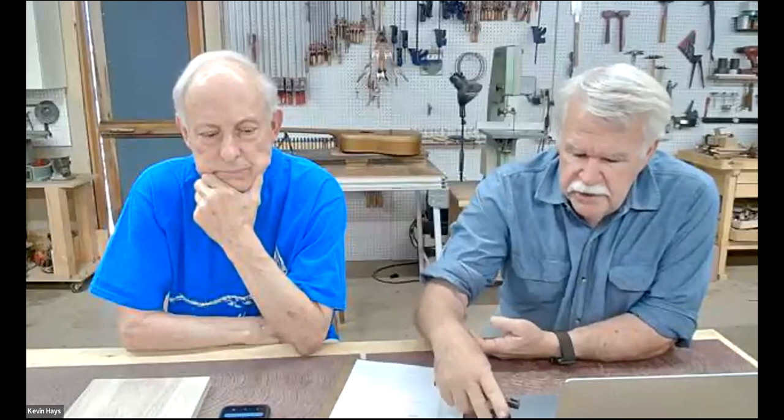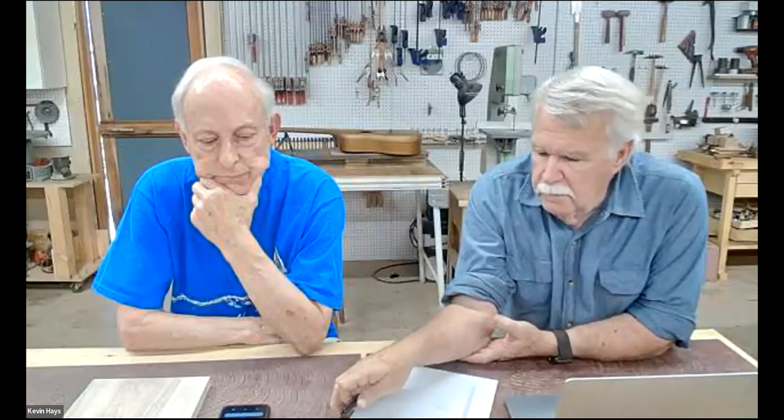Okay. Yeah, I wanted to address that a little bit. One of the things I did professionally, in addition to the woodworking, was there's a science about drying things down. It's called psychrometry, the study of getting rid of moisture in building materials. That was the business I was in, and it relates to dry down and dehumidification. I've dried a lot of wood. I think Steve mentioned a year per inch of wood. That's the rule of thumb, and it's a great rule of thumb. It's something you go by default.